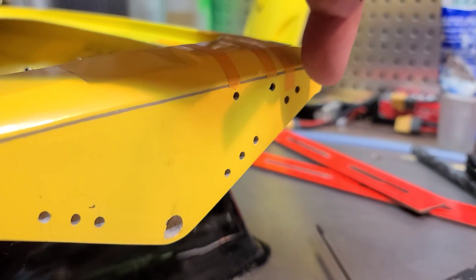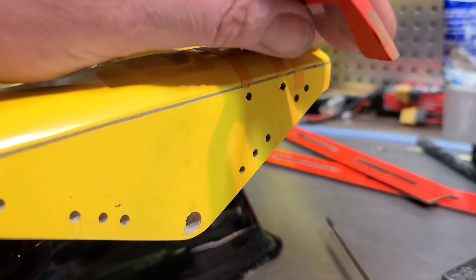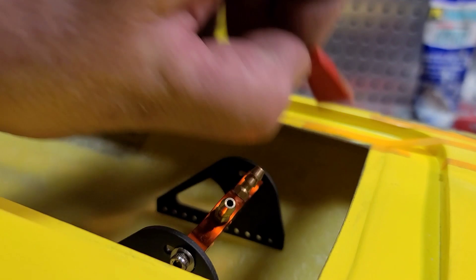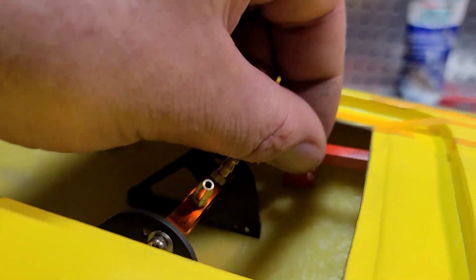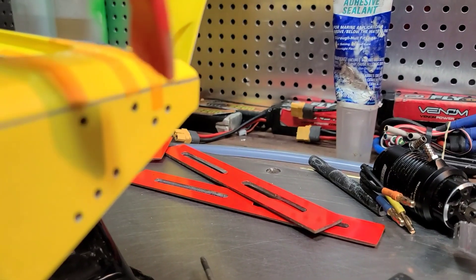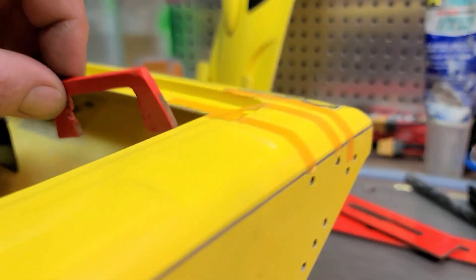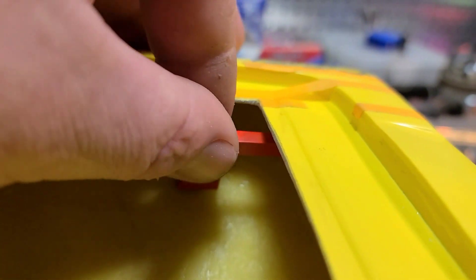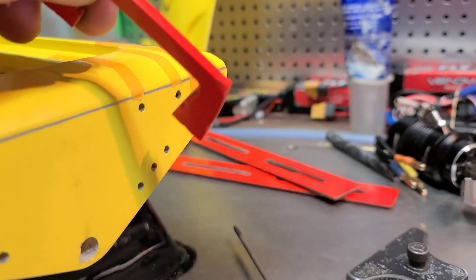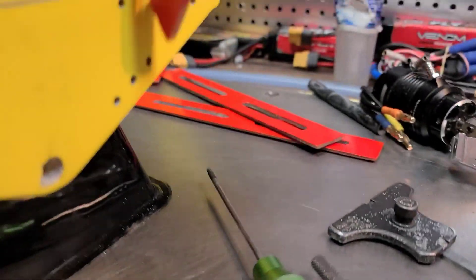I'm going to go ahead and start installing the rudder base, trim tabs, and turn fin on this side of the boat. I have to install my servo mount that I made — it's going to go in this back corner right here. I need to install this first. I don't want to block off any of my holes, so I want to go ahead and epoxy or seal up all my transom hardware on the right side so I can get a good placement for this servo mount. In case I need to remove any of my hardware in the future, I don't want to block off any of the screws.